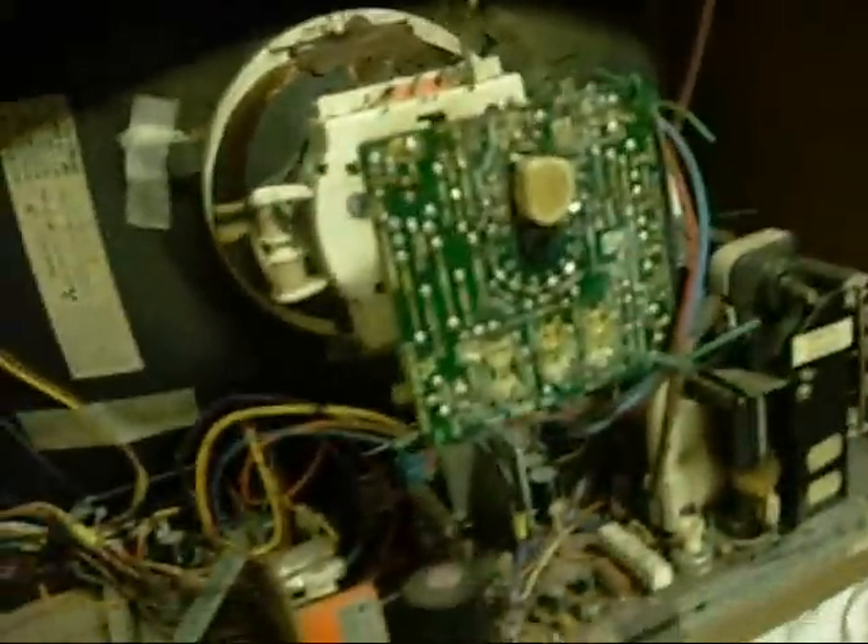Discharge it to ground — and this braiding in here is the best place to attach to. It's a capacitor; you've got a negative side and positive side. The inside is lined with lead and other materials — phosphor and other stuff. There are no sodium or reactive metals in them though. The neck board has been re-soldered and scrubbed down, so they've obviously dealt with dry joints. It's got modern capacitors on it, so that's been rebuilt, but there are a lot more dried-up looking ones in here.